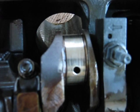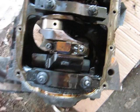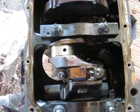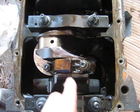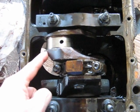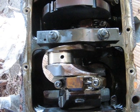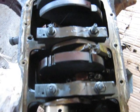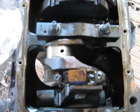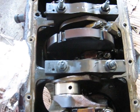It didn't really scar the crankshaft up much. Along with that, I noticed another something that could be a difficulty for building the Deltic — the crank pins are offset. I was expecting them to be in line with one another, so I'll have to take a close look at whether that causes our Deltic project some insurmountable difficulties, because you can't change that. That would have to do with the piston phasing.